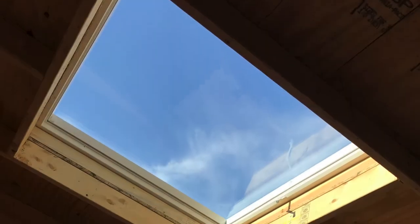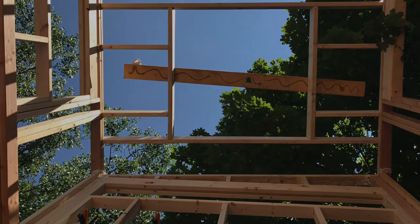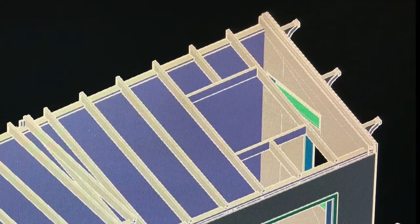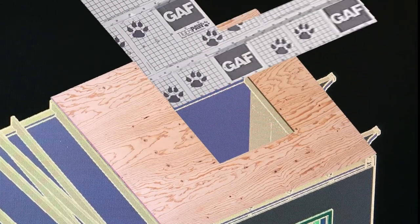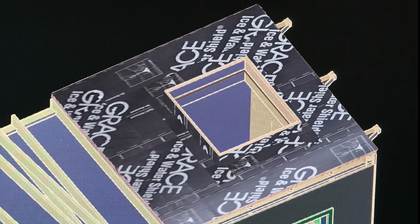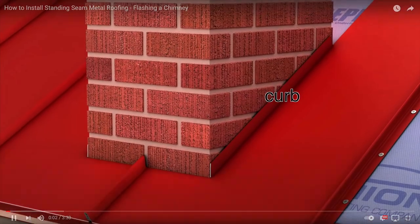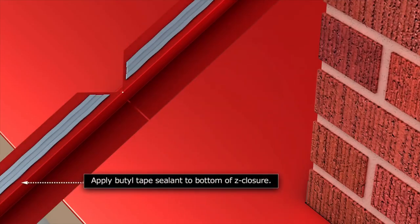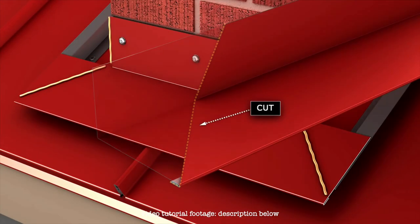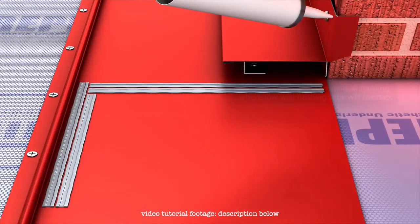Framing for your skylights is simple. The dimensions of the skylights will most often conform to standard framing specifications. Tim chose to frame their house using a 24-inch on-center standard, and their skylights are 49 and a half inches square. Add an additional 2-by-4 frame to the top of your skylight framing. This extrusion is called the curb, represented here by a chimney. The skylight will slip over the curb once the curb is properly clad in a precise application of metal roofing elements working from low to high and overlapping each layer with subsequent elements. This process is known as shingling. Maybe.